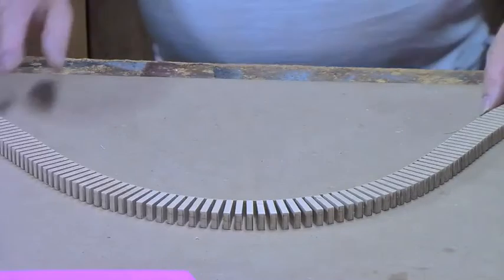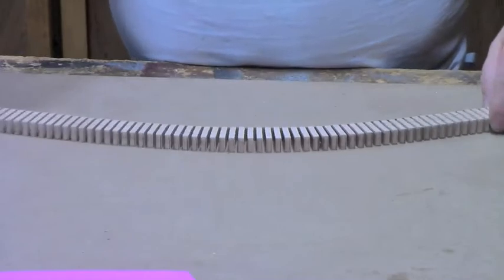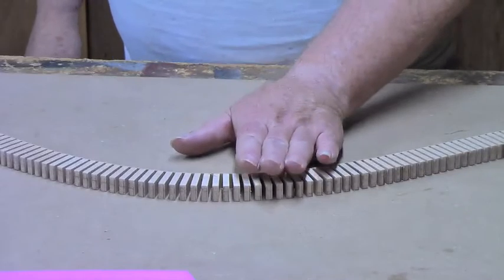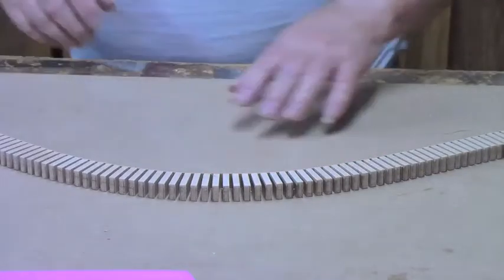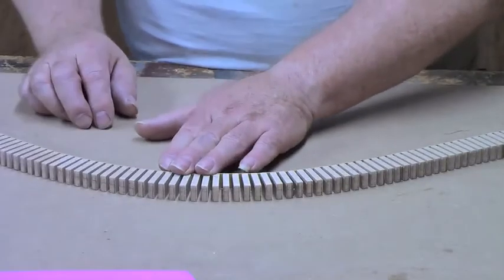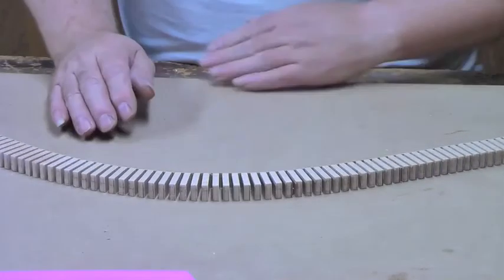Okay, as you can see, this is extremely flexible. If I had it to do over again, I would have made this a little thicker than a 1/2 inch. That way I could put something 1/2 inch thick in here as a circle to keep this round. As it is, when I put a 1/2 inch piece in the middle, it's the same height as this. So when I put the ring on the top, I won't be putting pressure just on the maple ring.